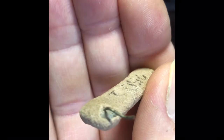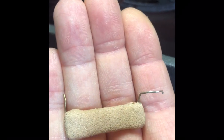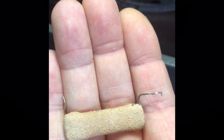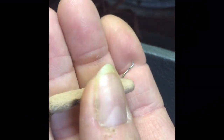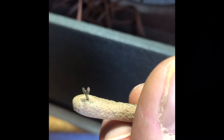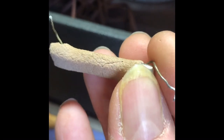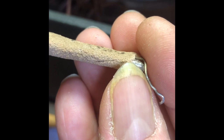Well, here is the dropping resistor that I mentioned before. Also, it's testing good. You can see that it shows discoloration and has some cracks in the shell. So, yeah, we're gonna change that to make sure that this resistor works fine.